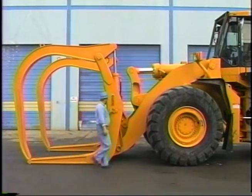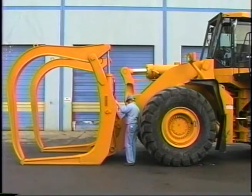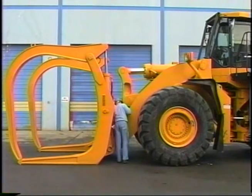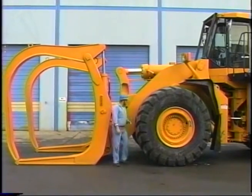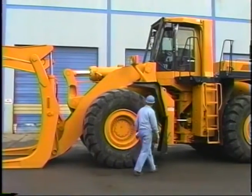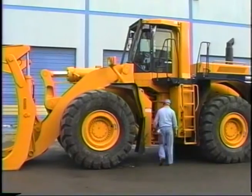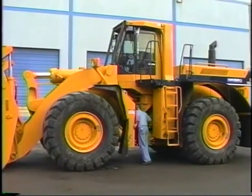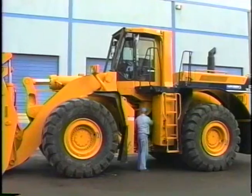Inspect the left front of the machine, checking the left clamp cylinder, the hoses and grease lines, the tilt cylinder, and the left hoist cylinder for leakage or damage. After inspecting the left front tire for punctures or slices, check the left side steering cylinder for damage and leakage. Also check for leaking grease lines or hydraulic hoses.